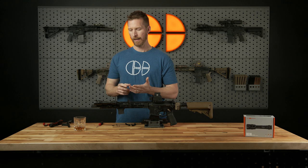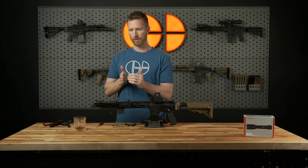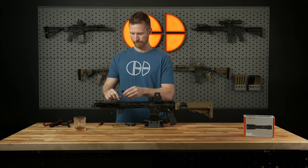What you don't want is your cable moving on you or getting snagged. Whenever that cable flexes and moves, it work hardens — as the term is — and that leads to failures in the cable. So again, we're doing these things for a reason, and that is the explanation behind the cable.